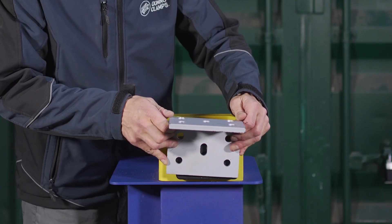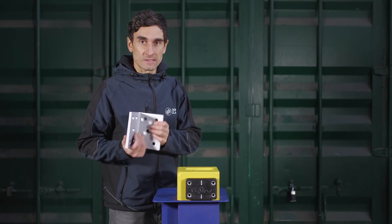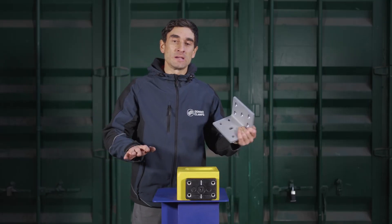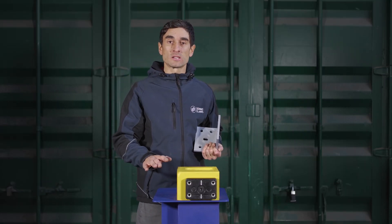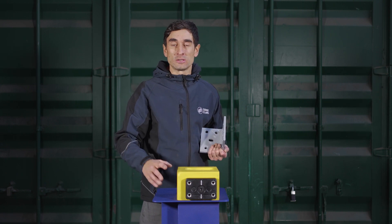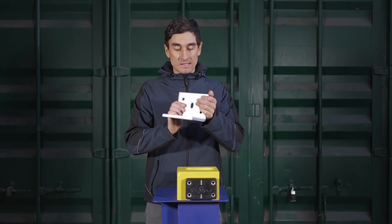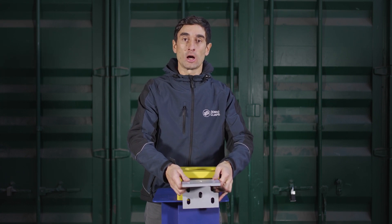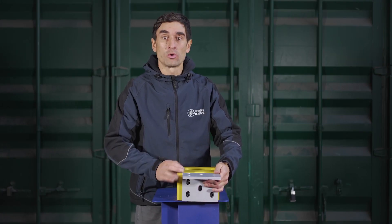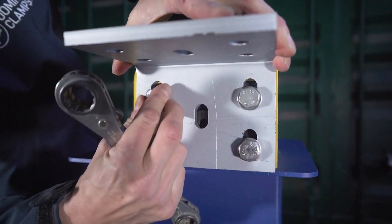As you can see, we can use this in the shelf-up position or the shelf-down position, and that can be used in the top or bottom corner castings. In the shelf-up position, the top of the shelf lines up more or less with the top of the corner casting — that's going to vary a bit depending on the tolerances of the corner casting itself and whether you've chosen to attach into the shield or the stadium holes; the shield sits about five millimeters lower than the stadium. On the other side of the angle bracket we've given you slotted holes so that its vertical position on the Domino Clamp can be adjusted up or down. If you need more precise adjustment of exactly where this shelf fits — perhaps in line with the top of the corner casting or the top of the roof itself — move it into position using these slotted holes and tighten up the bolts on the front once it's at the desired height.